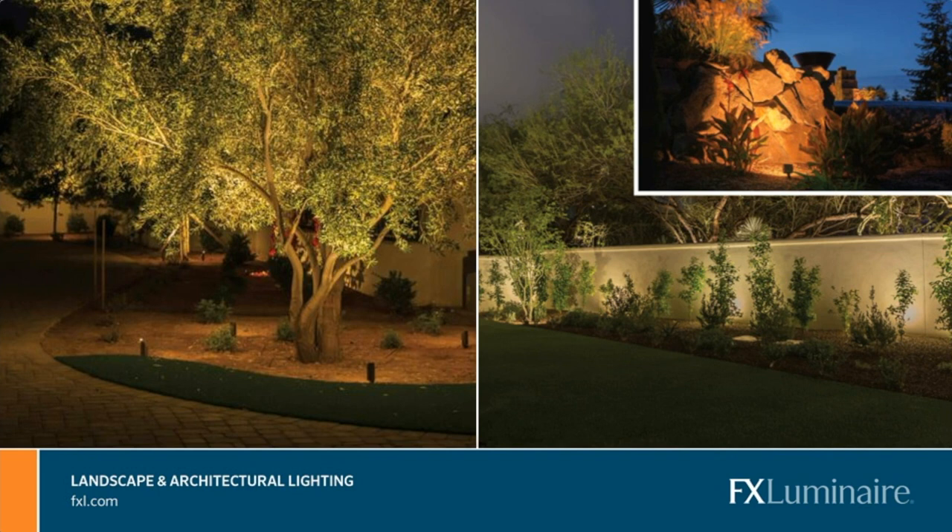We always want to have two lights on a tree, and typically your beam spreads are a little bit more narrow — anywhere from 20 to 40 degrees or so. As we start spreading wider, you typically come up with more of a wall wash look. In wall wash effects, your beam angles are going to be anywhere from 90 to 120 degrees. The purpose behind wall washes is to add depth, dimension, and an endpoint to make your spaces feel bigger and add that final border.